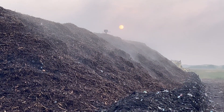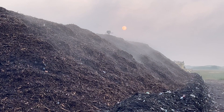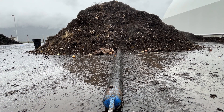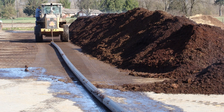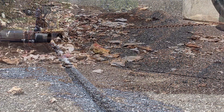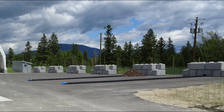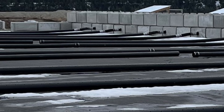We've been using above-ground HDPE piping underneath aerated windrows for more than 10 years. This requires thick-walled piping as it gets pulled out from underneath the pile to facilitate faster mixing. The above-ground piping allows composting on less costly asphalt surfaces. The pipes need to be welded and not joined together with couplers, as thermal expansion may cause some issues.